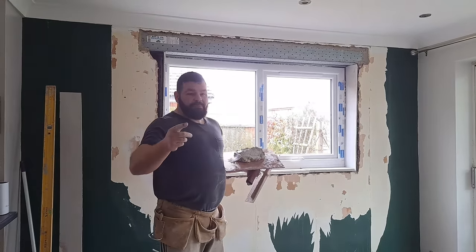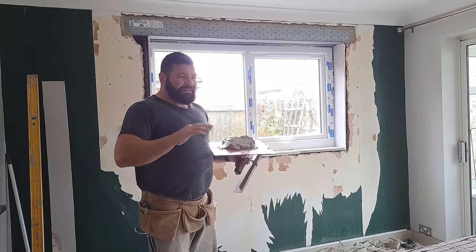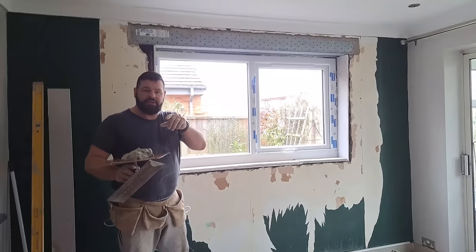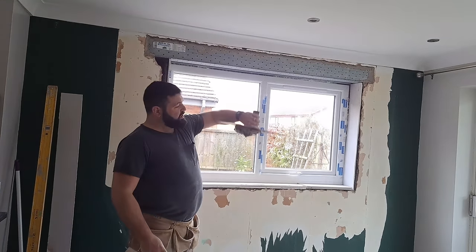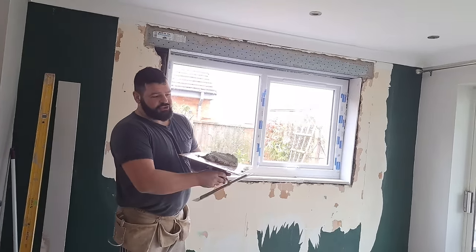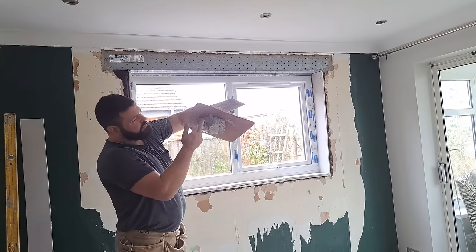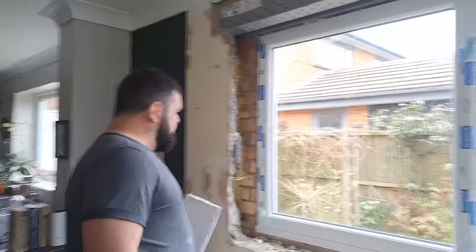So when people have said to me in the past, "Well, if you completely kill the suction, doesn't that mean the plaster will fall off?" No, it's different. One type of suction is where you've got bone dry plaster drawing moisture out of what you're using, which is bad suction. You don't want that, so you can try and kill that off. And then there's the suction that keeps wet plaster stuck to the bottom of your handboard, to your ceiling, to whatever you're plastering on. So you can use SBR and it will kill the suction, but it doesn't mean that it will fall off. We've just killed the suction on this handboard with water, but this is still stuck to it. Does that make sense?